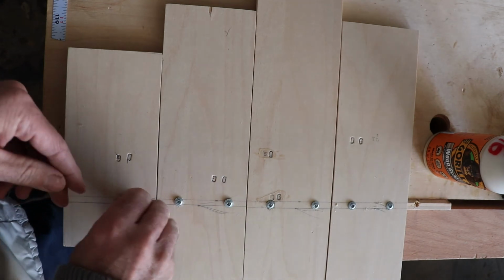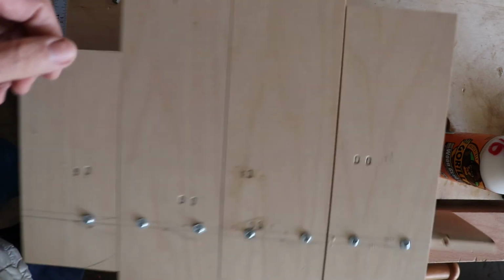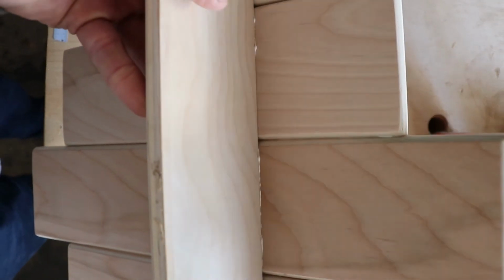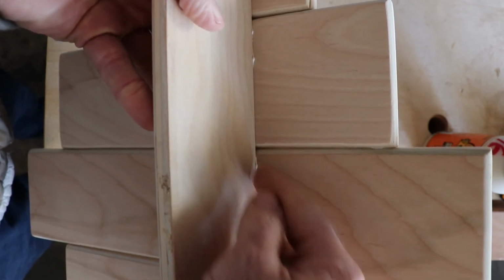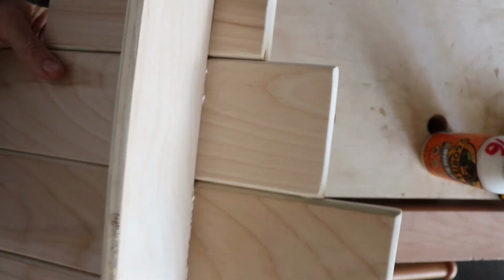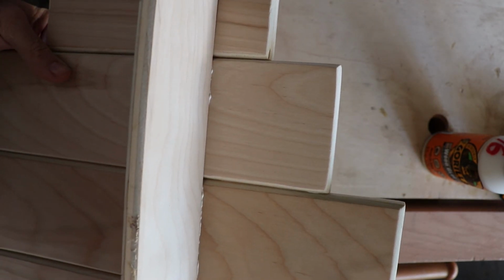Once you're done, you're going to flip this over, loosen it from here, and you're going to check. So for example, right here, I have glue. So I'm going to get one of the blue chisels, and I'm going to scrape that clean, because if you don't, then the stain won't work. And I'm going to take that, then once it's scraped all off, and wipe it on just a scrap piece of wood from the trash.